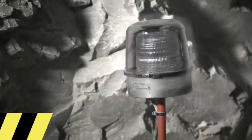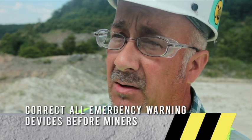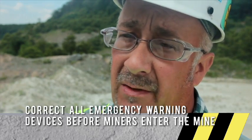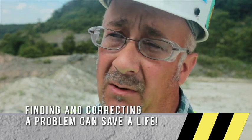The mine is equipped with an emergency evacuation lighting system that I check every day. I turn them on and drive through the mine to ensure they're all working. During my pre-shift, I activate all strobe lights to ensure they're working — strobe lights are like a first aid kit; they're there but we hope we never have to use them. There was a time I entered the mine during the pre-shift and discovered that one strobe had not been functional — it turned out to be just a bulb. I was able to do the repair before letting anyone in the mine, because miners are forbidden to go in with the strobes not working. We have seven activation points located throughout the mine, and any one of them will activate the system.